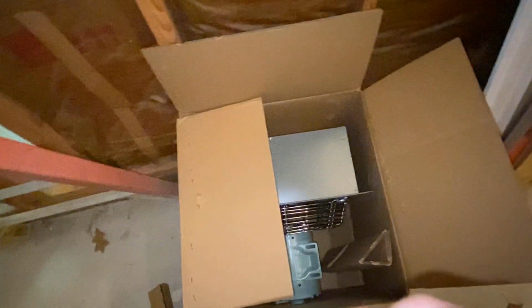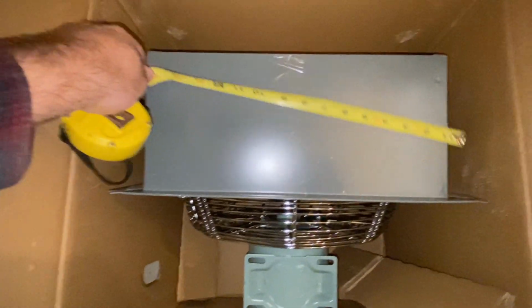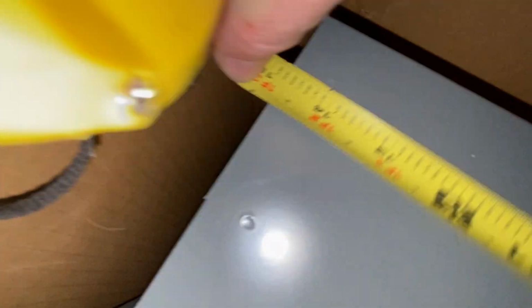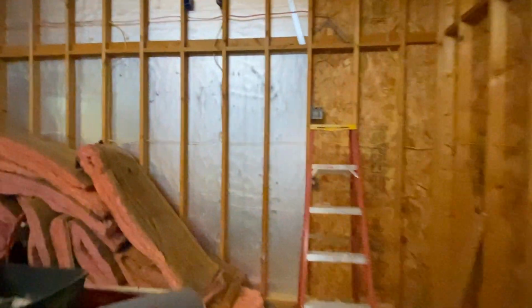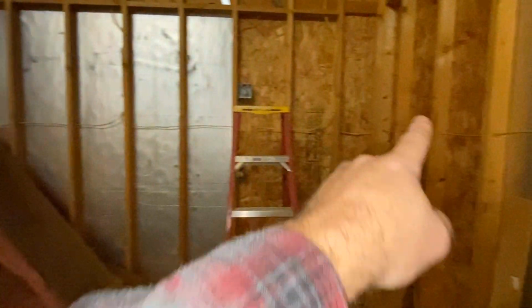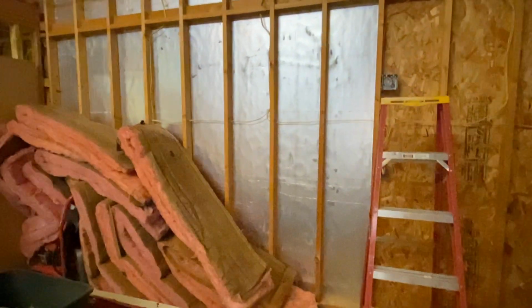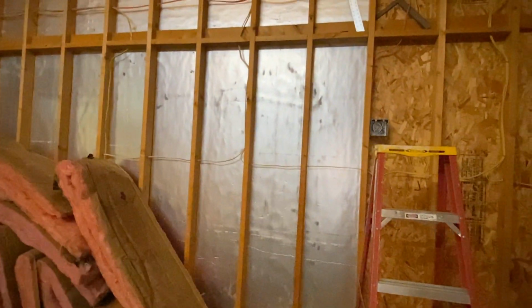The size of this box here is almost 15 inches. As a matter of fact, the framing says to frame it out to 15 by 15, but it's actually like 14 7/8, give or take. You see it? It's about 14 7/8. So I come over here, I'm like, okay. Yeah, this is the garage that was built by the pig that built the straw house and the 3 little pigs. Because there's no sheathing on this garage, except for in the corners. That's just like inch-thick Celotex, and then the siding stapled to it. Yeah, it's not the greatest, but eventually, if I ever reside this house, I'll probably end up having this resheathed, so it's a little bit stronger, but it's been here 30 years and it hasn't fallen down yet, so.